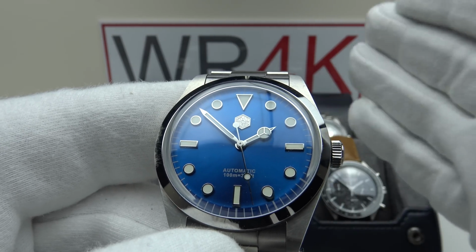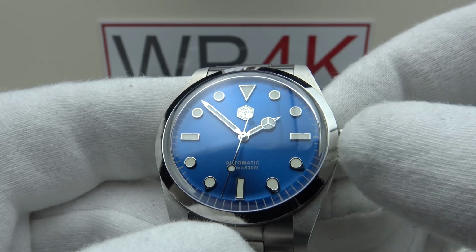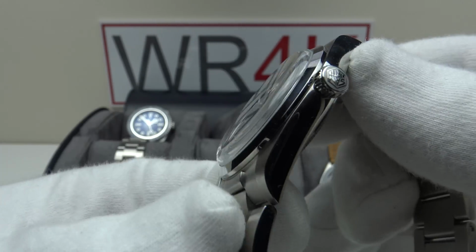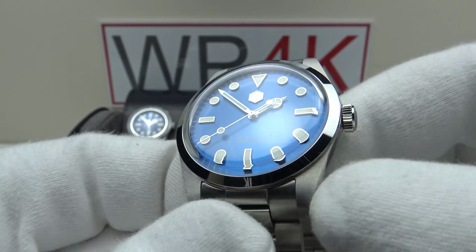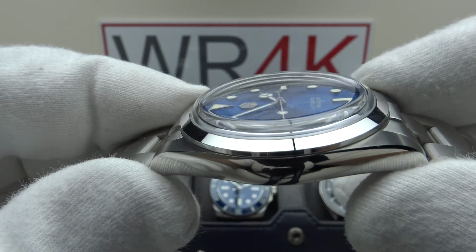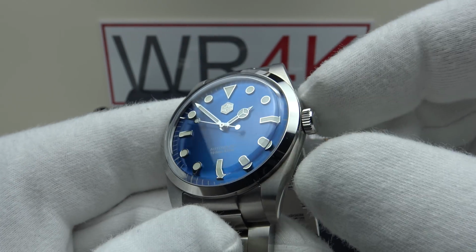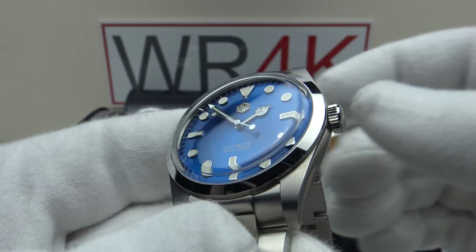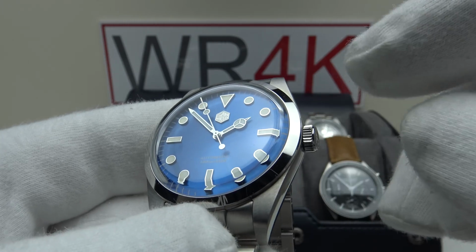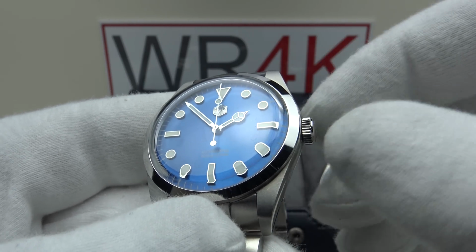San Martin actually made a very interesting comparison video between the 55A and the NH35A, where they broke down a 55A movement and they also put it on a timegrapher. And they've confirmed that the 55A is equal in build quality, quality control, materials and accuracy to the 35A respectively, so there's no discernible difference between the two. I regard them as equal in quality, and also the architecture of both movements is very similar. They feel the same to manually wind. I actually prefer the feeling of manually winding this 55A powered limited edition versus a PT5000 movement.